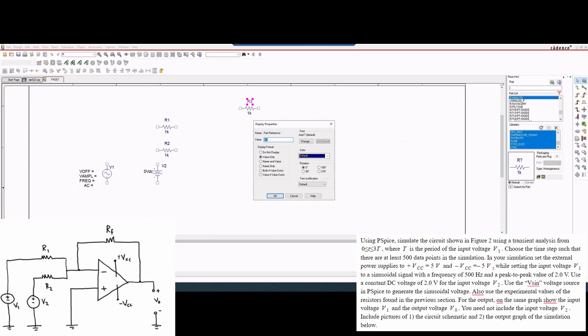And then we're going to have a resistor over here which we're going to call RF. Now the experimental values are going to vary, but these were measured with a multimeter. For R1 we're going to have 1.955K. For R2 we are going to have 0.955K. And then for RF we are going to have 0.991K. Then we can press Enter so we have all of our values set.